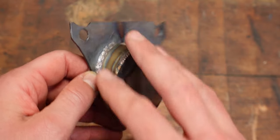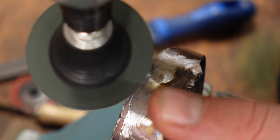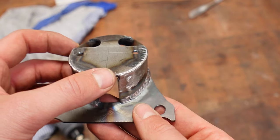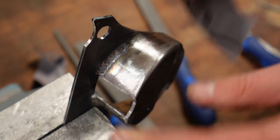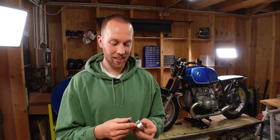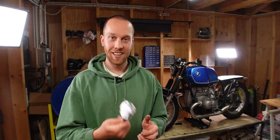This is what the piece looks like now that everything is welded up, so now it's time to make it look nice. The first step is to remove the weld marks. I start by taking off the top because there's less material there, and then work my way around the side to get a rough shape, which I can then refine with files and sanding paper. I'm finally done. This was so much work — so much tedious work — getting all of the transitions right, filing everywhere, and then giving it a nice surface finish. It just took forever. But this is what it looks like now.